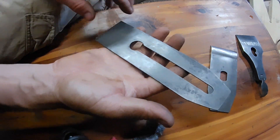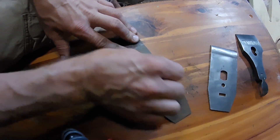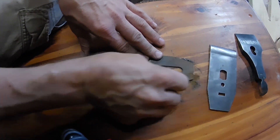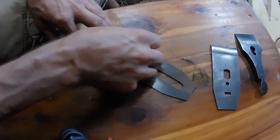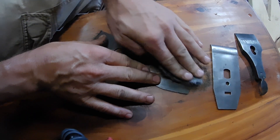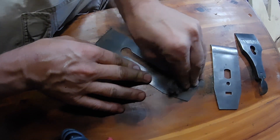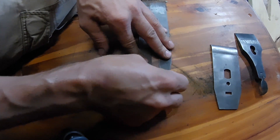After just a little bit of four-ought steel wool, I'm just rubbing it in the grain of the plane iron and it's coming off very, very easily — and these were pretty well rusted to begin with. But after just a little bit of time it starts knocking that rust back off and gets that little film that the Evapo-Rust leaves cleared off.